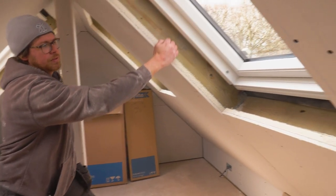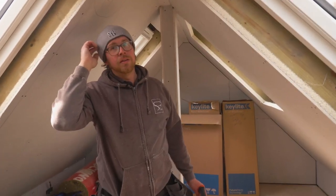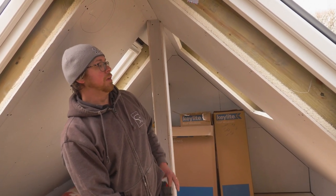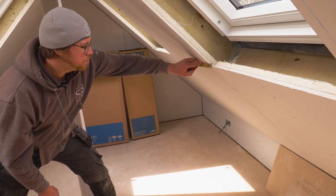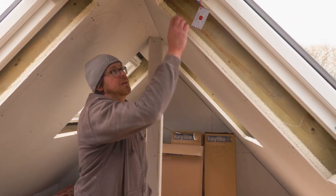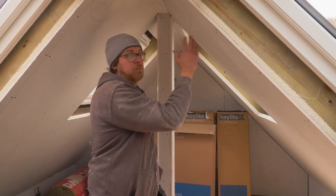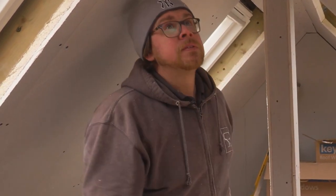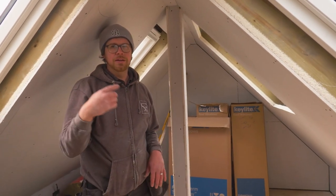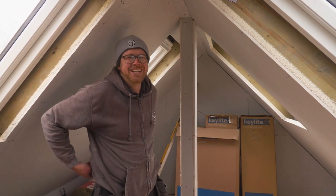Look at the difference on this side — quite a ridge going on, runs down a bit shallower there, but it gets bigger and bigger as we go up. It's amazing because we squared all these rafters through as well. Interestingly, even looking at the plasterboard — we've got a nice join here — we've got 28 there and 26 there, so the rafter is further out than the plasterboard. The plasterboards are nice and square; we started them from a square wall at the end and they've all fitted one against the other. It shows the rafter is very fractionally out. For what we're doing here it matters — and they're trimmers rather than rafters; we left them loose because we knew we were going to be putting windows in so something would be changed.